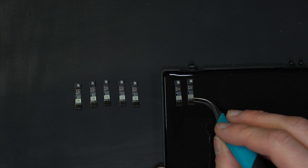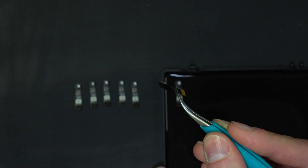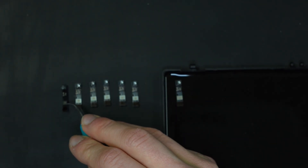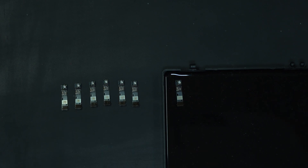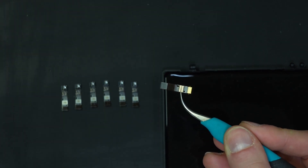I've been picking this device up — and you're going to tell me I shouldn't have. So I've broken the first rule of using your product. The sensor is typically handled using a stiffener on the sensor — you're supposed to handle it with tweezers or a vacuum pen. You're not allowed to touch any other part: the flex PCB, components, or the sensor part itself.